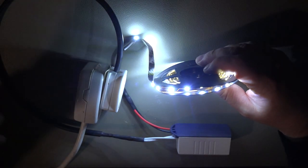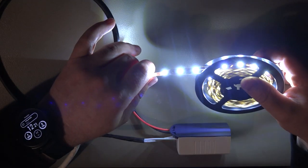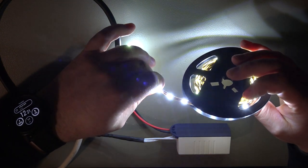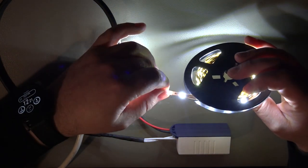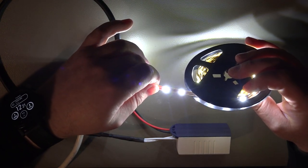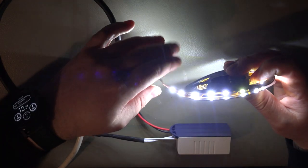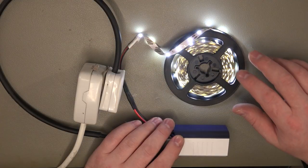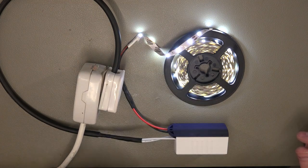You can see there it's not too bad — that should be reasonably okay. I don't think I'm too worried about warmth because it's going to be on the back of the mirror to take any heat away. If you wanted to dim it down a bit you could add a resistor. So the next stage is to get this on the back of the mirror.